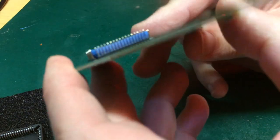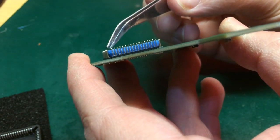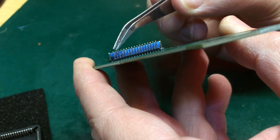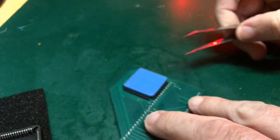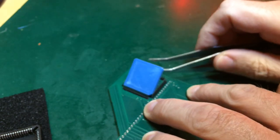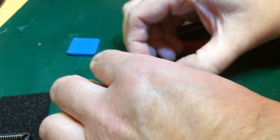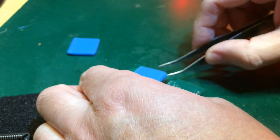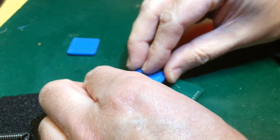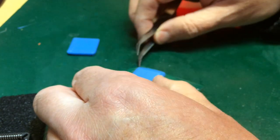This row that I just soldered here, I think, is leaning in too much, being pushed in by the socket, and so basically, my PLCC plug, I think, is just too small. So there's probably a happy medium between this one and this one. If I try and fit this one in here, I suspect it's not going to go because it's too wide. Might be able to apply a little bit of lateral pressure to the pins just soldered, maybe, to encourage it in? No. Asking too much of it, I think.